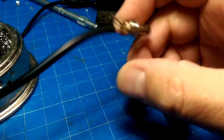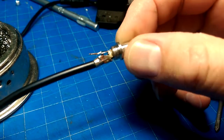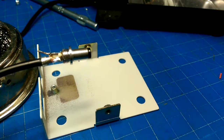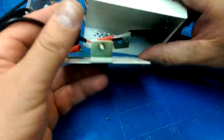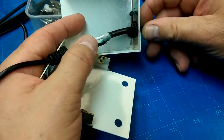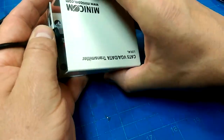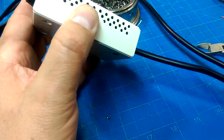The TS-100 needs a pretty flexible cable, and the laptop power cable wasn't working, so I'm rebuilding a little interface box between the power cable coming out of the laptop charger and plugging it into the TS-100. I've got a grounding strap, so at least what can be grounded is grounded. I've got some strain relief here with a grommet to keep it from vibrating and getting cut, and then I'll put another tie wrap around here to keep it from going in.